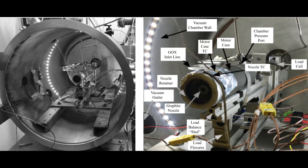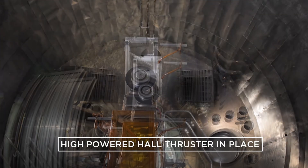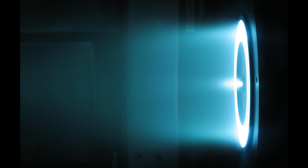Yes, you can put spacecraft in a vacuum chamber, and in fact you can test a rocket engine in a vacuum chamber. The problem is that once you start firing a rocket engine, it is emitting a lot of high-pressure hot exhaust gas, and if you don't have a very big vacuum chamber, it's going to fill up very quickly and you're not testing in vacuum anymore. You can actually do this for very low mass flow engines — things like electric thrusters can be tested in a vacuum chamber with mechanical vacuum pumps. You just get it down to whatever pressure you're testing at, and the mass flow rate of ion thrusters is so low that you can generally keep the chamber at usable pressure for a very long period of time.